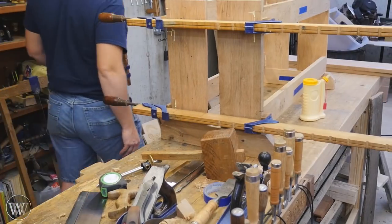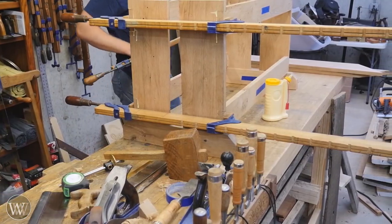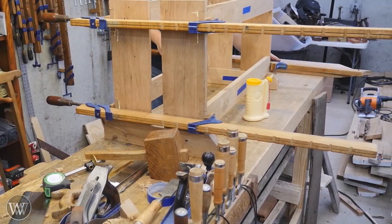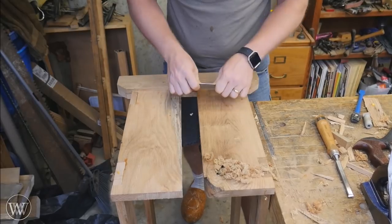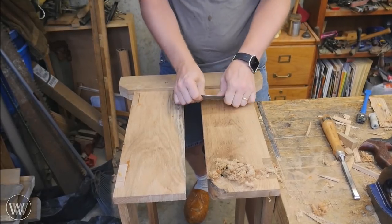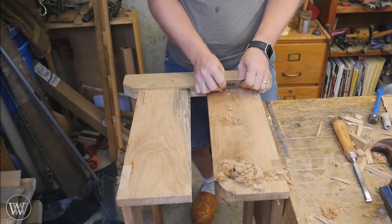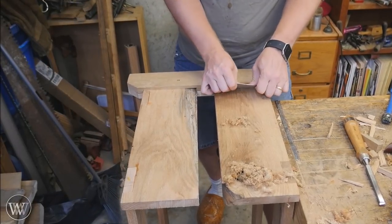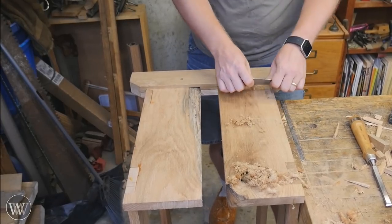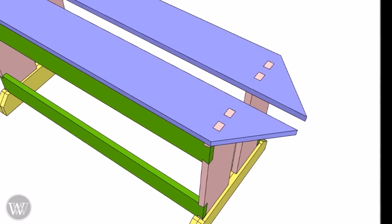Of course, dropping them on the bench really helps — the bruising builds character in the piece. Then we can clamp it up. I love working with these wooden clamps. After coming out of the clamp, I want to do some of the cleanup on it because I'm not going to get a chance to do that after the bench top is on — it's just a lot easier now. So I'll put it in the vise and use a card scraper. This is one I got from Bearcat Wood, playing with the new chair scraper, and I'm loving it.